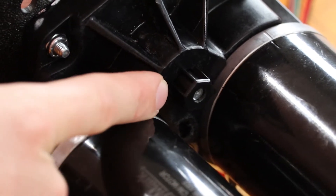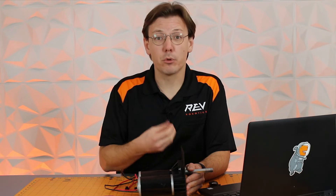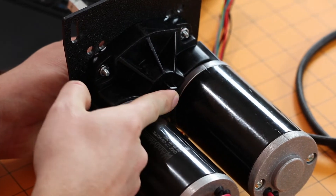If you're using the quarter inch round — typically found on the back of the FRC kitbot chassis gearbox — you'll need to go through a slightly different procedure. On this Toughbox Mini we have the quarter inch round pre-installed. The installation process is pretty straightforward: take your quarter inch round insert and put it in something that allows it to warm up. We typically recommend putting it in hot water for about a minute to allow it to expand a bit, then you're able to get it started by hand and press it onto the back shaft.